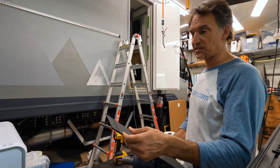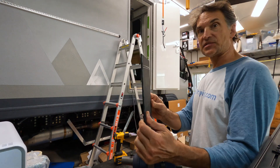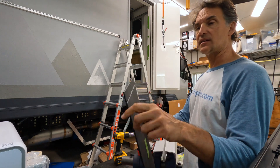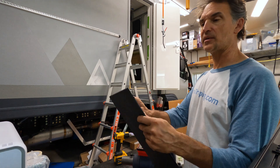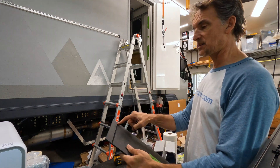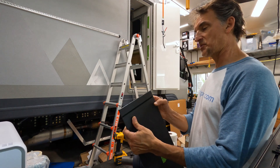I'm going to try bending this — never done this before, so we're going to learn together. I have my nice V-groove cut in there. It's cut pretty far through this quarter-inch HDPE — a little more than halfway through. So I'm just going to apply heat across this cut mark on both sides.